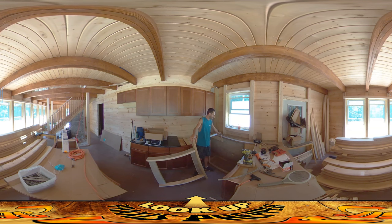One of the most interesting boards I put in yesterday was this one up on the back. It's being supported on these two boards that I ram set nailed into the concrete, but it's also being held up on the back concrete sill. It's actually slightly lower than the sill plate, so I had to notch it out on the back side. Because the concrete sill isn't completely flat the whole way along it, I over-notched this board and then put a run of mortar in the back and set the board down into the mortar, so it's nicely supported on the whole back edge and not putting all the weight on these boards here. It's nice and distributed.